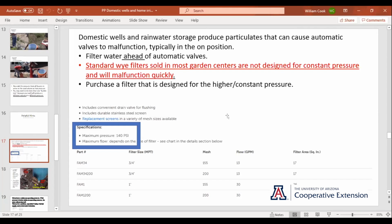And when I got this place here in Duncan, it turns out that it pumps just a little bit of sand, not a lot, but it doesn't take much either. A little bit of sand and occasionally a flake of rust from the well casing. And that stuff all goes right on down the line. So you get grit in your valve. What's going to happen is it's going to stop working. The most usual thing that'll happen is you'll get a little piece of grit under the plunger and the solenoid, and it'll just leak all the time, till you clean it.